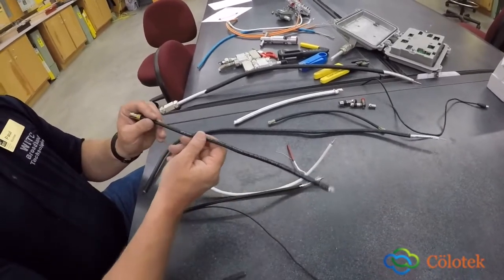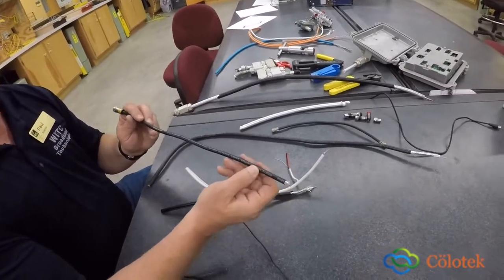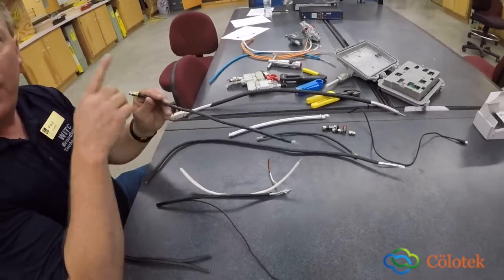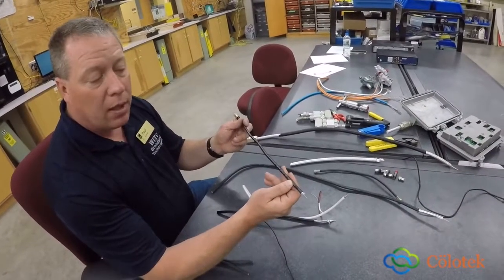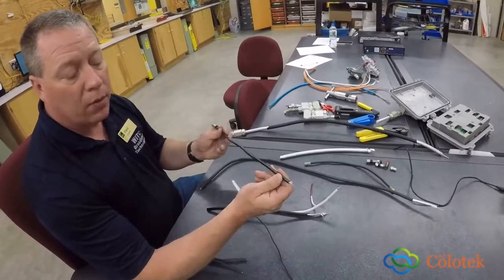This cable is manufactured for underground services. This is a drop cable, okay? And drop means it's going to go from the subscriber tap, and then buried to the actual network interface device that is connected to a ground block, which you'll see in a later video also.